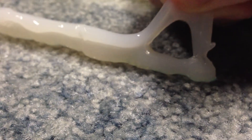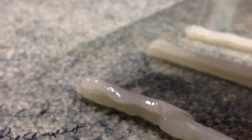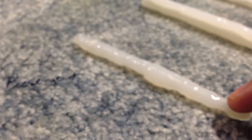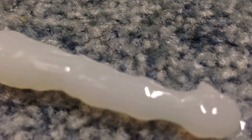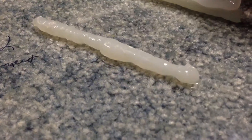I can't pull it off. There we go. I'm getting it. Looks like if I pull and really get in there, I can rip it off. Test one with the GE 2 basement window door and attic silicone - it bonded to the edges. You can actually see where it actually bonded into the silicone. My guess is that if I were to actually smear the bead on there - I didn't apply any pressure when I laid the bead, I just took it and drifted across - if I were to pressure it down on there, it would have been a lot harder to get off.